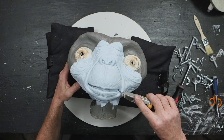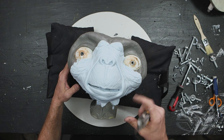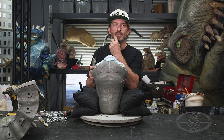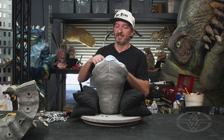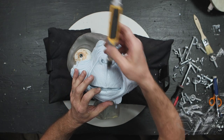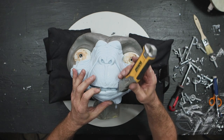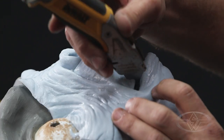So I'm cutting here in the corners of the mouth to check the thickness where I put those new standoffs, and I'm cutting in the middle of the lower lip. We really didn't do too much in the lower lip — the goal was just to clean up that cutting edge. The most important part is the new thickness of this upper lip, because in Bud's video, that was the part that was really on the thick side.